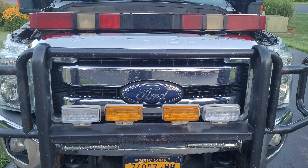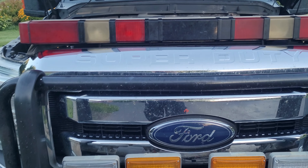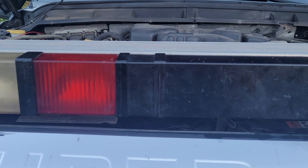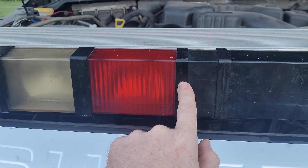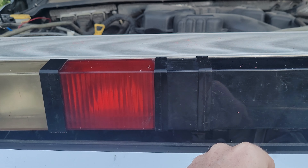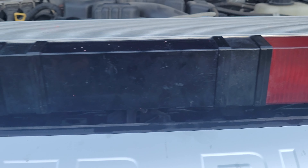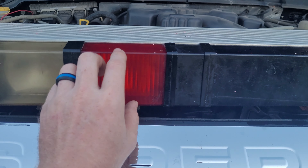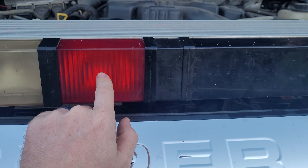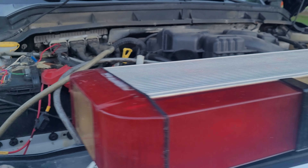So I had a working bar with a hodgepodge of lenses, and I had lenses that needed a bar — there you go. The front is almost entirely Edge 9000 pieces. The notable exception between first-generation and later-generation is just the gaskets: these first-generation gaskets are a lot thicker — a full inch thick — whereas these later-generation gaskets are only about three-quarters of an inch thick. They also have spacers here for the lengthened blackout piece in the center. On a later Edge 9000 these spacers wouldn't exist; the inner lenses would actually be a little longer.